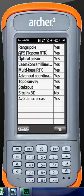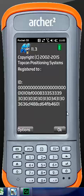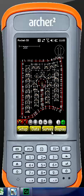Once we go into options, we can see we have GPS on, we can use a prism, millimeter GPS, multi-base, advanced coordinate, topo survey — everything's on except Site Link 3D. What Site Link 3D allows customers to do is send files from the office to the field — the data collector and machine control all have to be set up for it. It's a very powerful tool because it also allows an in-house support person to remote access the dozers, handheld, and excavator to troubleshoot. We can also do that from our office if you have Site Link active. If you're interested, we can definitely talk more about it. Hit OK to get back, and that's about it for the basic setup.